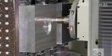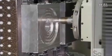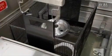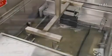To build the laser resonator, they mill two blocks of aluminum. Each will hold a mirror on opposite ends of the resonator. They will reflect light back and forth inside the chamber to form the laser beam. All the parts go into a cleaning solution because any contaminants would shorten the laser's life.